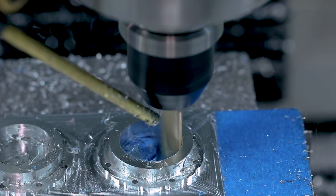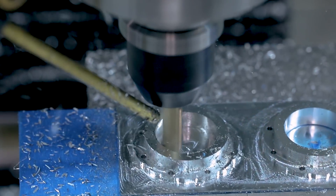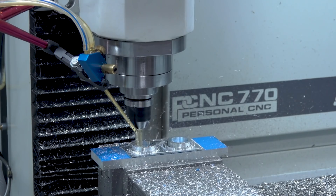Cleaning up those inside bores. If this were a really tight tolerance, you'll want to use something like Cutter Comp — card here to the page where we walk through how you can use Cutter Comp to stay at the machine and walk that out and really hold pretty tight tolerances.